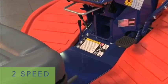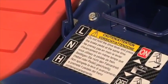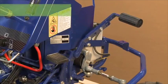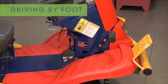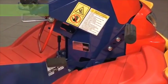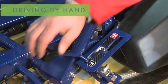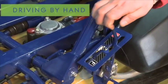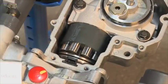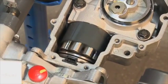Razorbacks are fitted with a high and low range gearbox, providing excellent torque for climbing and allowing forward speeds up to 14 kilometres an hour. The Razorbacks offer driving versatility — you have the option to drive the machine by either foot control with a heel and toe action, or in many steeper hillside situations you may prefer using the hand control. Either way, the transmission moves from forward to reverse motion with ease.